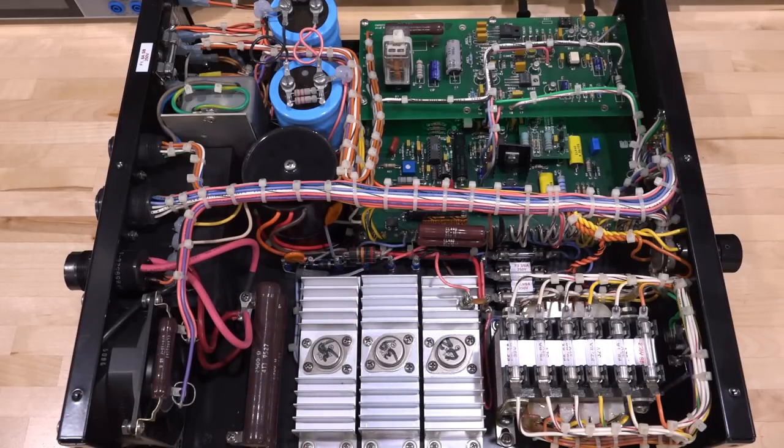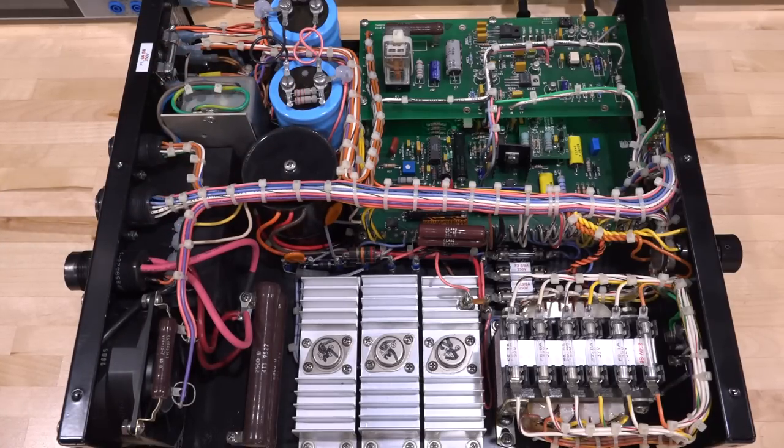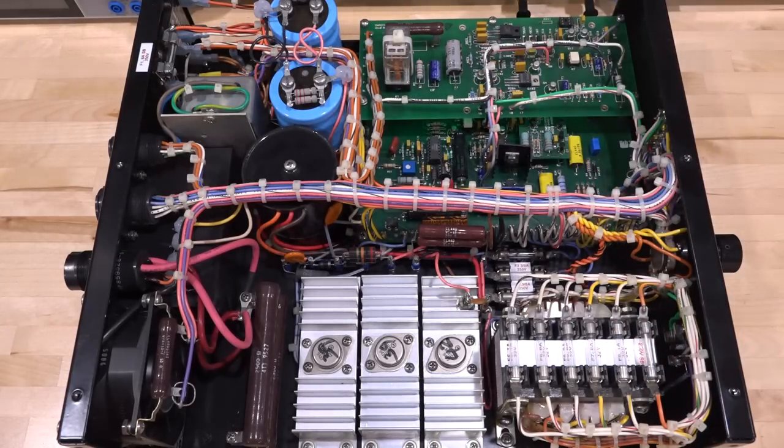There's a cover here that manages the thermal airflow over these heat sinks — which are sitting at live voltages, so very dangerous — and some big power resistors that need to be cooled. The fan is right over here. Look at all the fuses, all of them labeled. The job of this power supply is a few things: it provides high voltage to the laser head via these potted components, it provides power to all the filaments at low voltages, it has several timers to manage the shutdown and power-run sequence, and it has multiple closed-loop systems for the cadmium and helium reservoirs — all handled over these few PCBs.